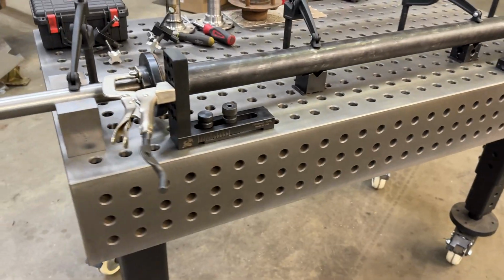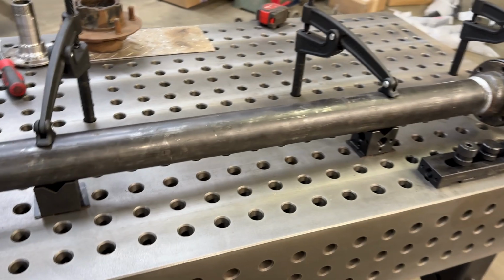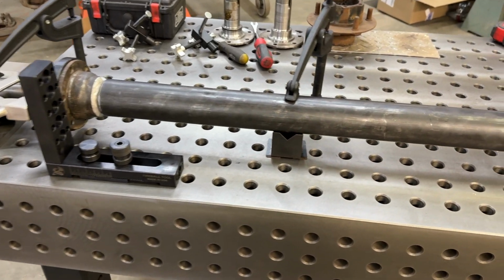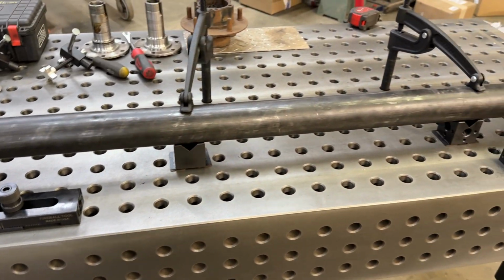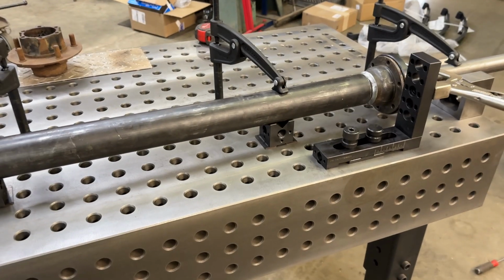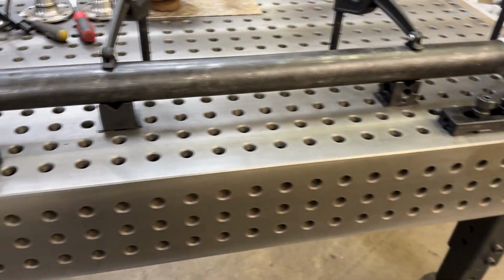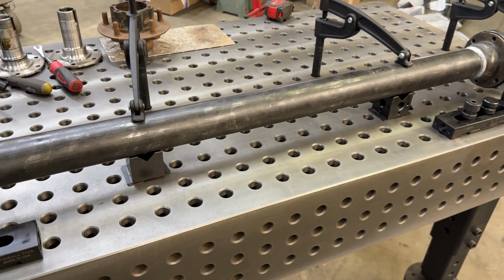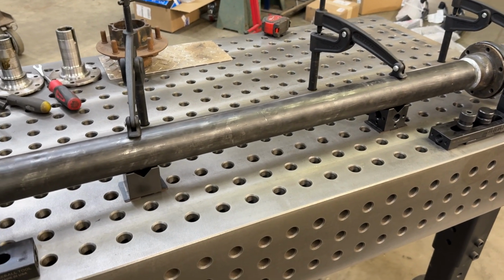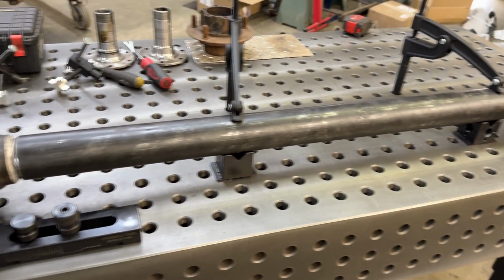So what we're trying to do here is, a customer came to me. He's got a Jeep trailer, but what they did with it is they just put an AMC 20 rear axle under it out of a CJ5, so it's still a narrow track version. He really just wanted to put a regular trailer axle under it. Why? Because you don't have that differential and everything turning inside. He doesn't need the brakes, all that stuff. So my idea was, since he's going to be towing it behind an early CJ5, why don't we try and make the spindle and hub assemblies work on the trailer axle.